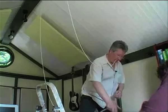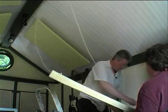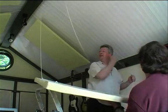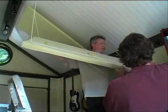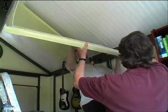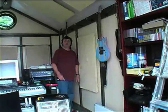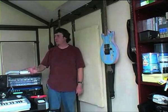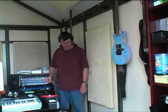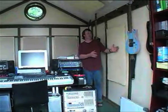We've got three of the panels up now, trying to do the fourth out of six. Doing this on the hottest day of the year at the top of the building is not the most brilliant idea we've ever had, but it is working well. The final part of the acoustic treatment is to hang up a couple of these rockwool panels at the mirror points, either side of the listening position, one on either wall. The best way of finding the mirror point, if you don't know intuitively, is to sit in the chair and get a friend to hold up a mirror — if you can see the monitor in the mirror, that's the place for the absorber.